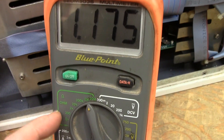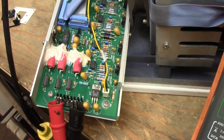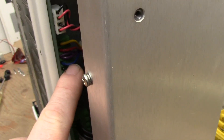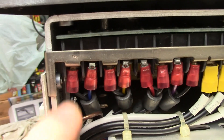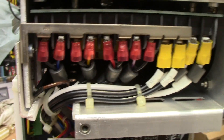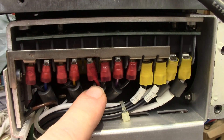It's not as simple as this board having a short on 12 volts — with the multimeter attached we're about one megaohm and going down, that could just be a capacitor. That's still pretty high — it's fine. So it's not this board. The red wire goes in here and into the back plane, and there's another red wire that snakes back up to the power supply. So we have ground, one rail, ground, one rail — there's our 12 volts. All of the grounds are currently tied together, so the color coding's good. I've beeped this out and yes, there is a path from here up to there. Now I need to see if I can separate the power supply from that connector, which is proving to be a challenge — the screw terminals are hard to reach.